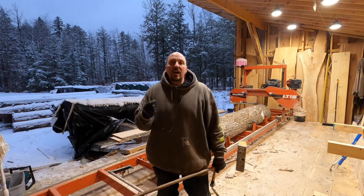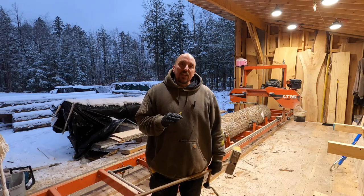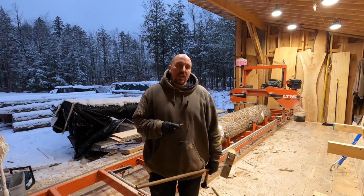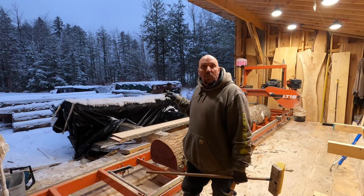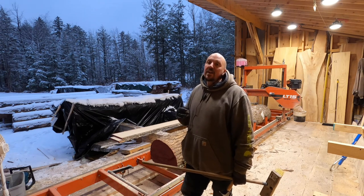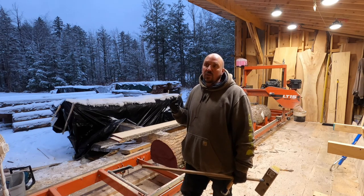Because we dragged this out over gravel and through dirt and everything else, we tried to lift it and keep it out of the muck. Still keeping an eye out so we don't run the blade into debris. Before the weather turned and we started getting snow and rain, we covered it with tarps to cut down on prep time. The four degree blades are working really well on maple, ash, and other hardwoods we're cutting.